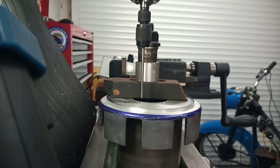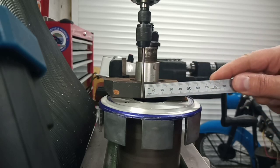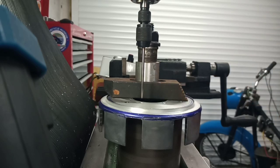And we're going to drill through at 4 millimetres, which is our countersink size. You'll see the countersinking tool, which I've got from my many years of aircraft sheet metal work. I've got a special tool, which some of you may have seen before and may not. We'll see. Show you that in a bit. But we're going to have to be careful because we haven't got a lot of land. And what I mean by land is the distance from the edge of the material to the centre of the hole. And for effective riveting, it needs to be 2D, really.